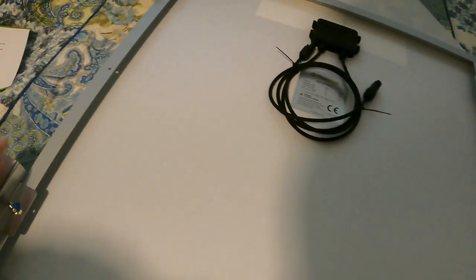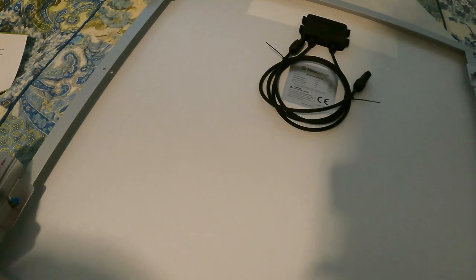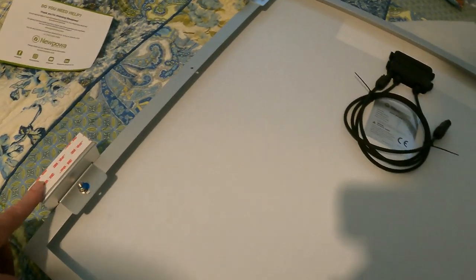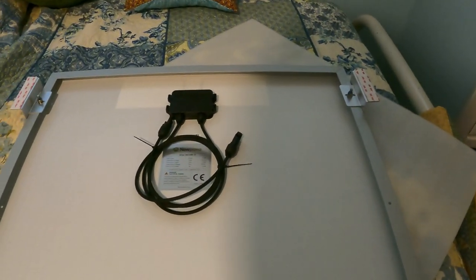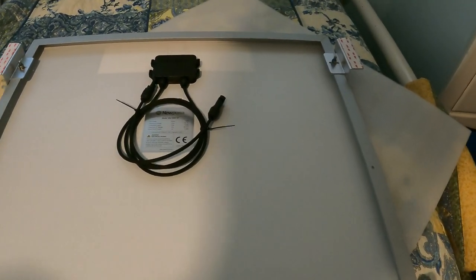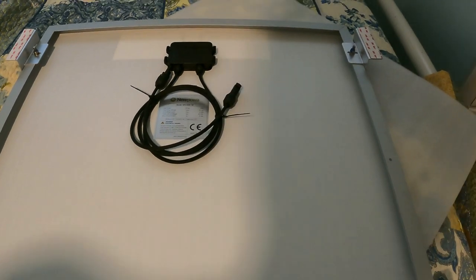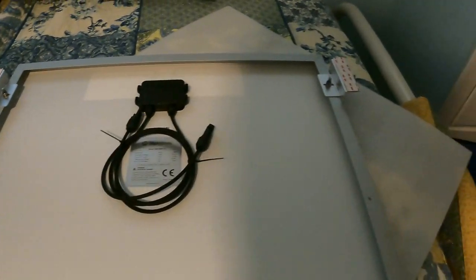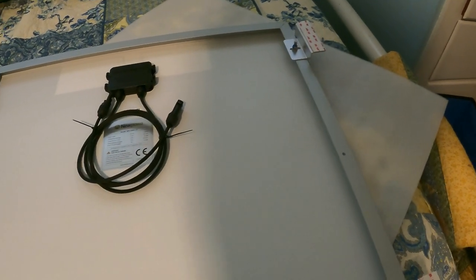And even these are on the side. The feet work better on the side. You have to bend these just a little to conform to the roof on the side, but not much. That's what you want, where you just alter these a little and then they'll stick down flat and give you a solid mounting surface for the feet to mount to the fiberglass.